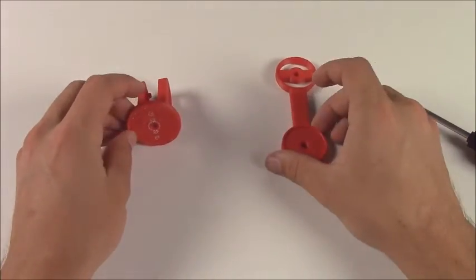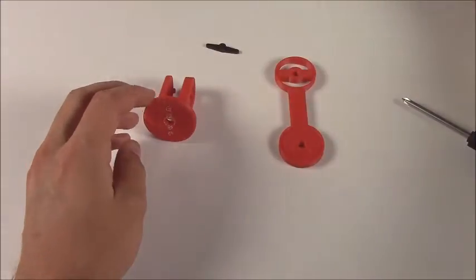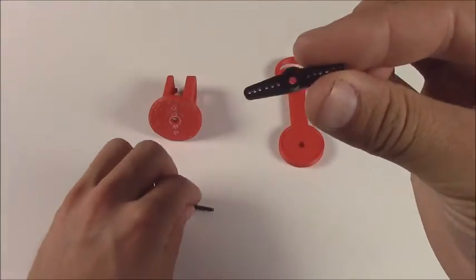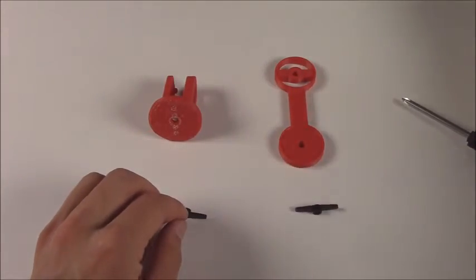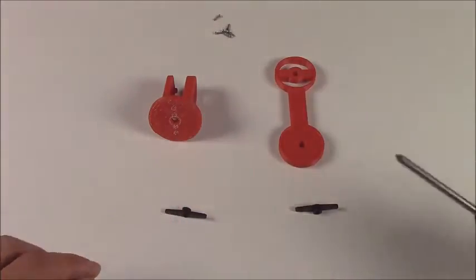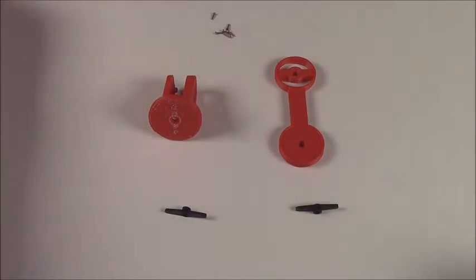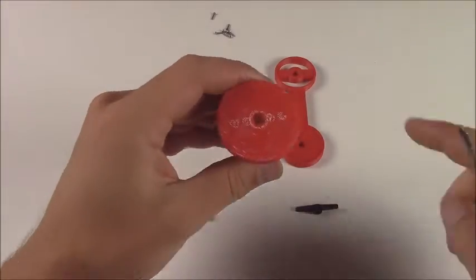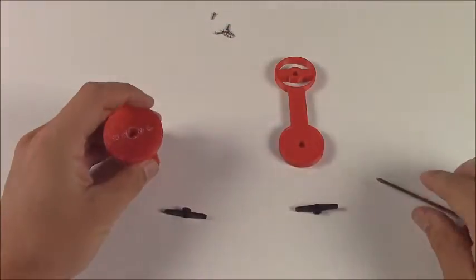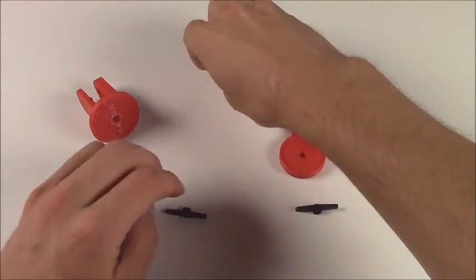Now the shoulder and the upper arm. We're going to go ahead and mount horns to these, the servo horns right here, as you can see. Each one of the horns has multiple holes to go through. We'll show you which ones of those to put the screws through. You need about 4 of the small screws. A typical Phillips head screwdriver is too clunky for this, so you want a really fine tipped one to work with these screws. Otherwise you just won't get any purchase. The shoulder has 4 mounting holes along the bottom. You only need to use 2 of them.